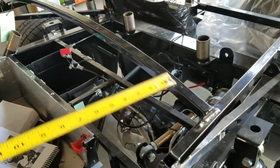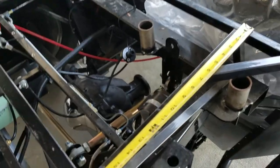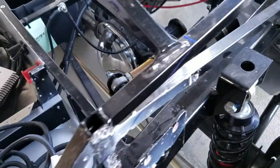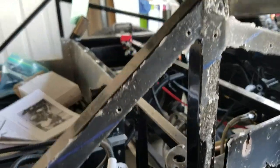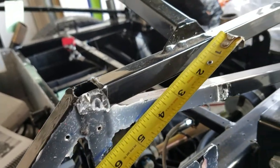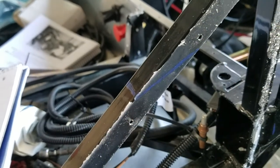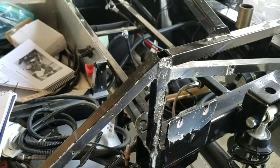Second, I'm going to cut off this hoop. Third, from 15½ inches to here at our mark, I'm going to start cutting along this blue line. The reason for this blue line being at this angle is that it is 12 inches long — so I can put a 3¼ inch piece of tubing that's about 12 inches long in that spot.